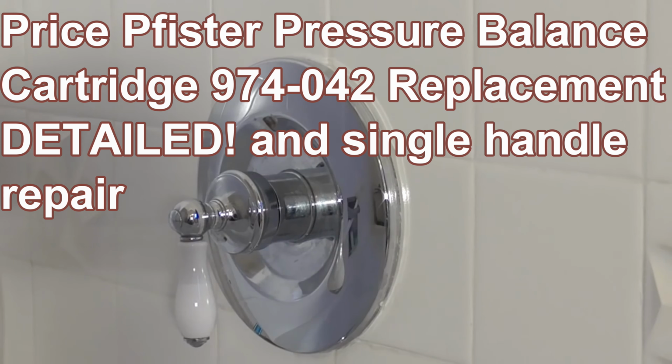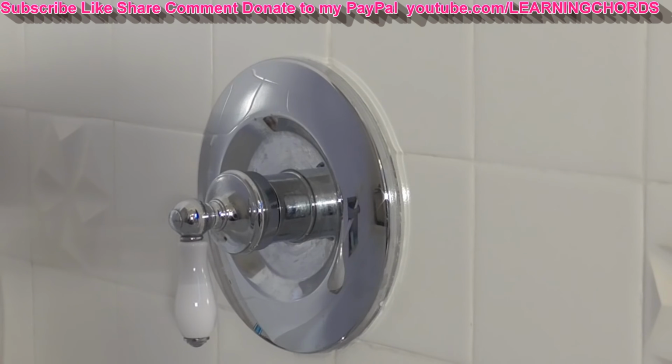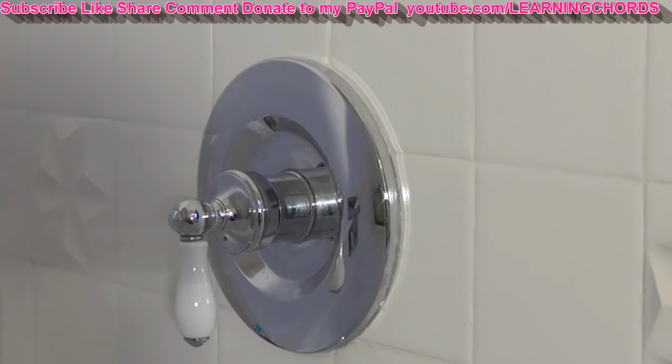This is going to be a video on the Pfister single handle bathtub or shower faucet, which you are looking at right now. They call it a single handle, obviously, because there is a single handle. Most of the problems that you'll have with these are tight turning, it doesn't turn, or it's frozen, or it's difficult to turn, or there is leaking. Normally that is caused by a part that's called the pressure balance cartridge, or the cartridge.